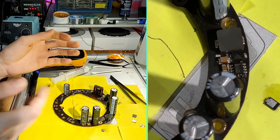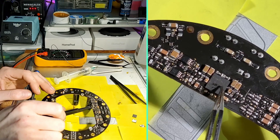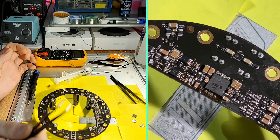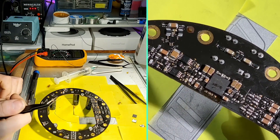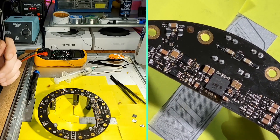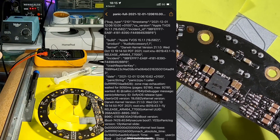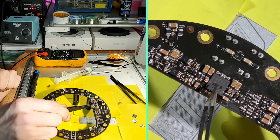So let's move on to the amplifier IC. This chip is responsible for amplifying the subwoofer signal. When it starts to fail, you may hear loud pops followed by a restart, no subwoofer volume, or crackling in the bass during playback. There is a similar pop and restart because of a software bug which was fixed in OS 15.3. You'll know if it's the bug if you're on an older version of OS 15 and you have a panic log in your HomePod's analytics. Without the panic log and with an up-to-date OS, if yours is popping and restarting, it's probably this chip.